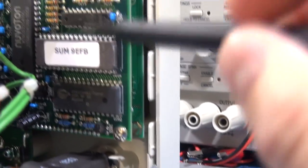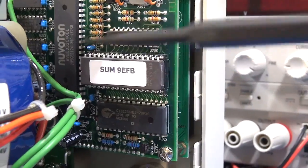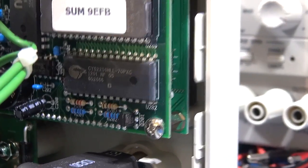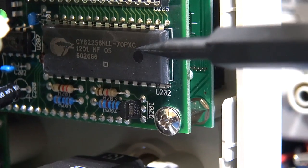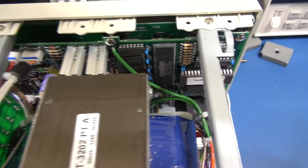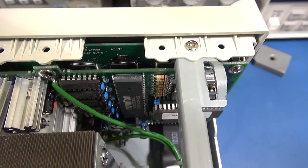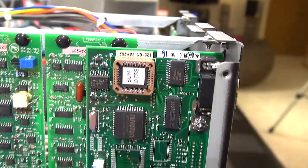On the side of the unit I think we've now identified where the two EEPROMs are. This will be one of them and the other one was the first IC package we looked at. Below here you'll see this IC — it's Cypress Semiconductors, if I've got their name correct — and this happens to be a 256k memory. So that is the internals: the heatsink at the back, the big transformer, the microcontroller, and over there I presume those are drivers for the display up front.